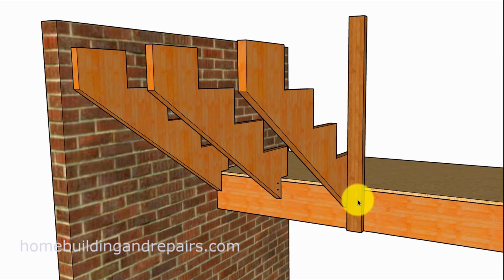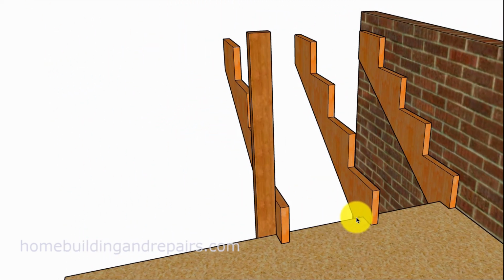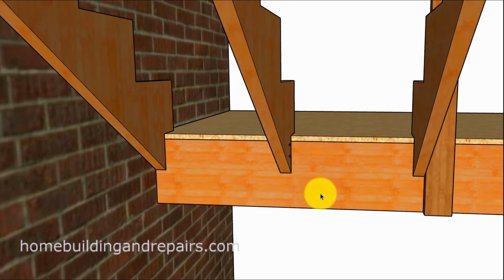Same thing on the other side when you have some type of a handrail board or a stringer right next to it. And this is the situation that they had. They had some type of a notch like this over the beam, and this isn't the ideal stair connection, obviously, and that's probably why the inspector suggested that they install something.